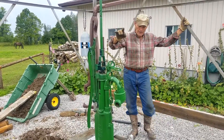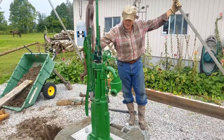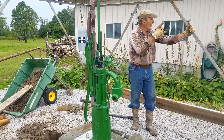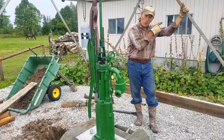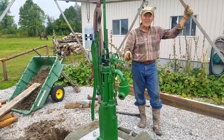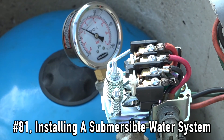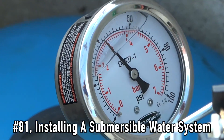So let's discuss the problem first of all. This is our well and our windmill, which is up there spinning and hooks up to our pump so we can water everything. We also use this well for the hydrant here at the garage for washing the tractor and bulldozer. Then we have another hydrant connected to it over the barn, 150 feet away, filling the chicken and horse troughs. Down in the well I have a submersible pump — an electric submersible pump — that comes up one-inch pipe. There's a pressure switch and pressure gauge near the surface, and a pressure tank as well.